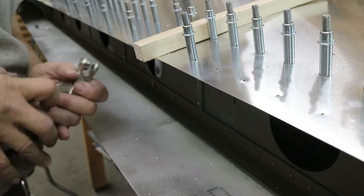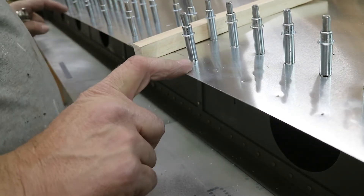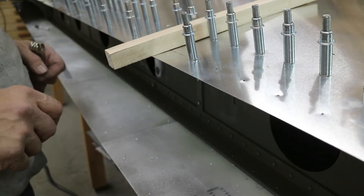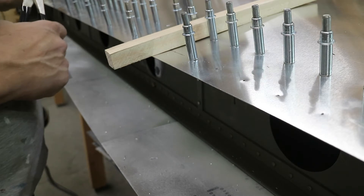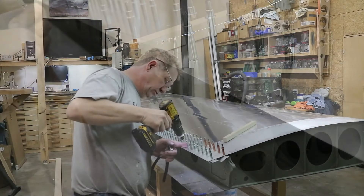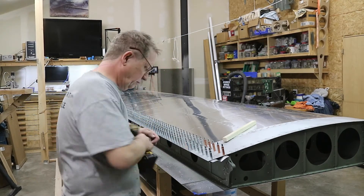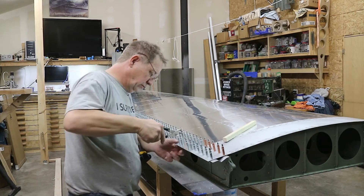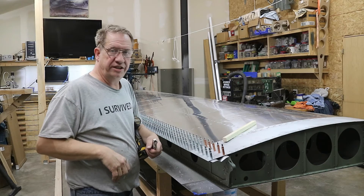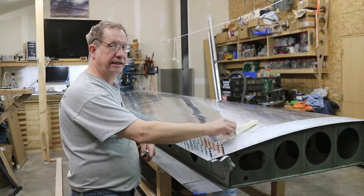The gap's a lot better - I've still got three or four more holes to work on with. I don't want to just have two or three holes holding it in position. That'll be my game for a little bit - it just has a problem right in this area, not the whole wing. I just finished doing all the clecoes for that lower edge, so now I'll pull it all off and deburr and dimple.